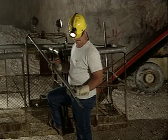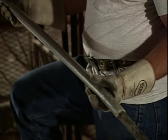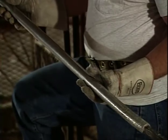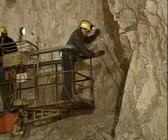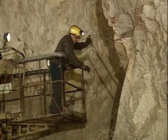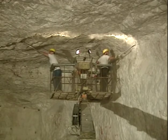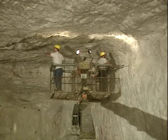If you are a hand scaler, inspect your pry bar for any damage or excessive wear and tear. When working in an area, hold the blunt end of the bar to the side of your body in such a way that unexpected movement of the rock will not cause the bar to strike you. When you're using the bar, push up rather than down — it's much safer.